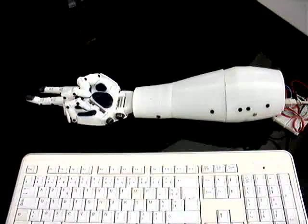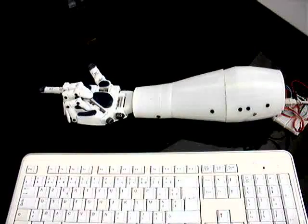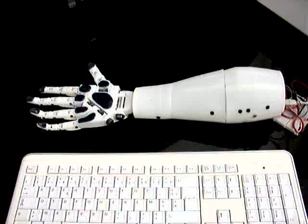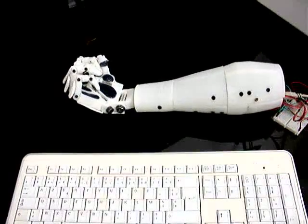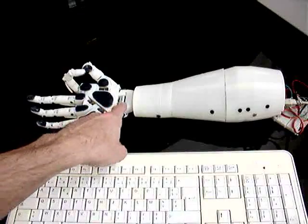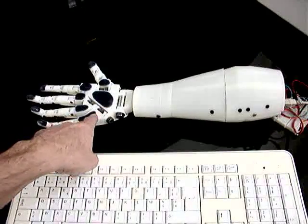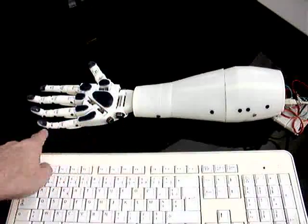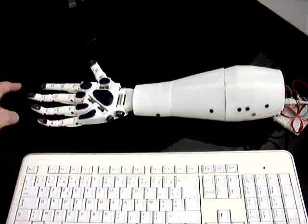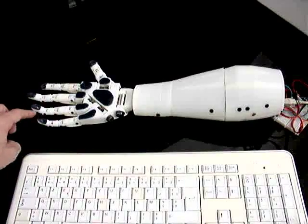Here it's taking one movement, another one, then one more — grabbing a fragile thing, let's say. Back to first position. I had to change the cables. I used different cables from the beginning — I started with tennis filament, tennis cords, but they were too tight, too hard, and the fingers couldn't bend correctly. Now I used nylon of 0.8 millimeters, which makes it much more easy for the fingers to fold and bend, and then they come back to the right position.